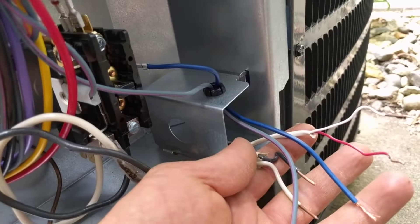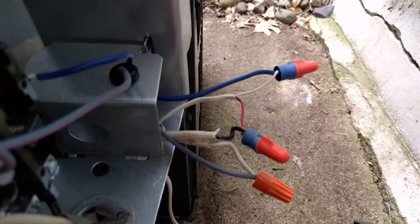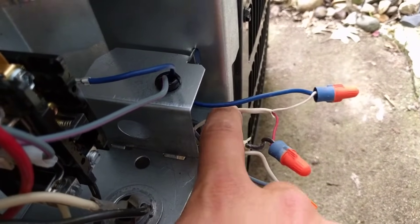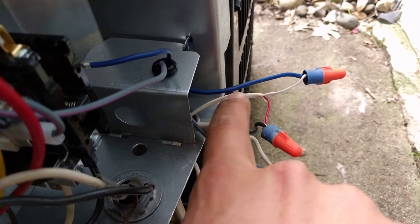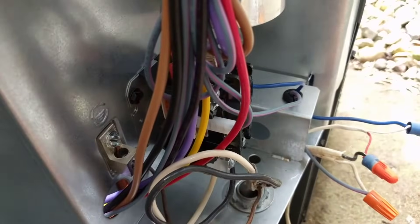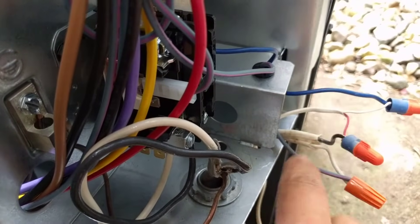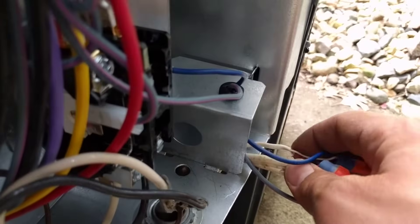So basically we have to hook all of these up here — I'll show you how they hook up. I'm just going to wire them together. So let's say that the power is coming from the Y on the furnace coming into this black one here. The black one then feeds into this control box. This white wire goes to the control box up there. If that control has the air conditioner turned on, then it'll send the voltage back down this white wire, which would then go to the blue wire, which goes to the contactor. The other side of the contactor is connected to the white wire, which is basically the common coming from the furnace. Normally this second wire from the thermostat or furnace would go straight to the second wire on the air conditioner — so this is a less typical scenario, but now you understand how it works.